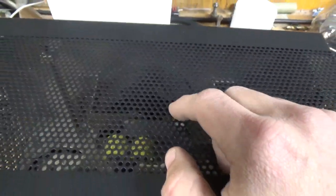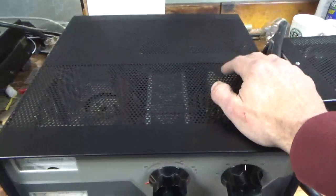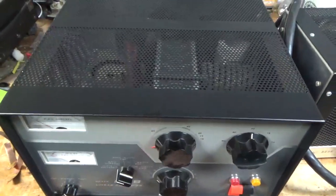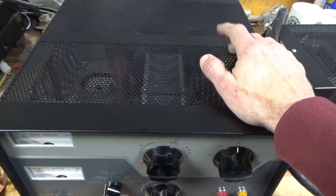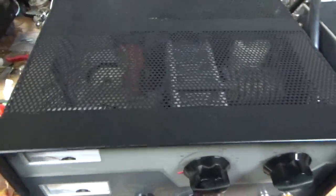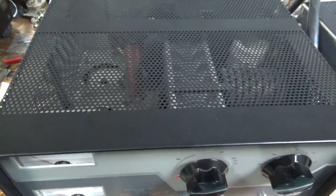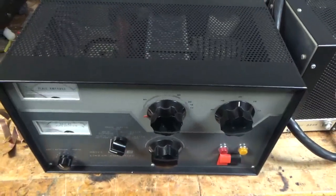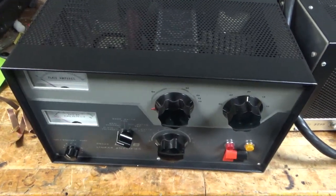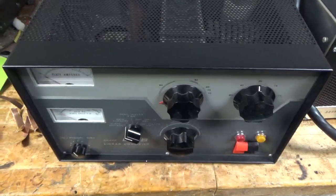Those impellers are delicate, and if one gets damaged you have to replace the whole assembly. I will oil the fan motor. I'm going to ground the grids. Change the electrolytic cap — 100-microfarad, 50-volt. I'll change that out and clean all the contacts for the TR/bias relay, the band switch, and the input rotary switch.